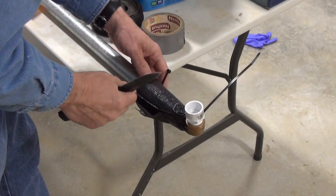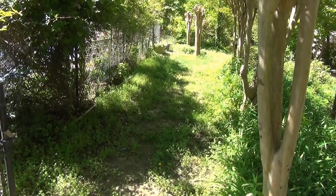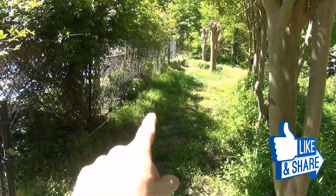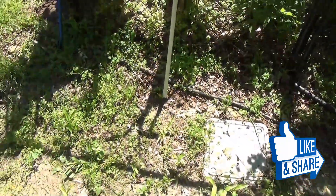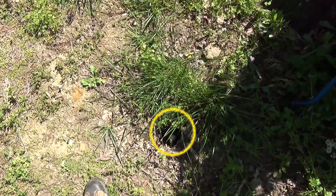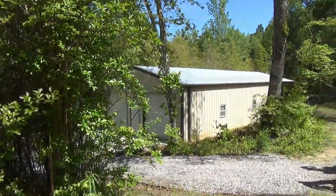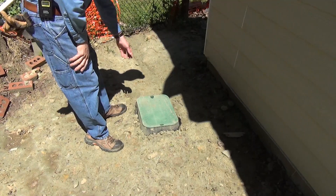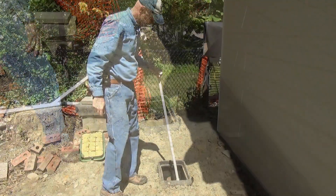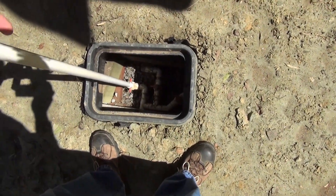As you may recall from when I was building my shop, the water line comes from behind the pool house and under the walkway, and comes along here. I have a tee off that pops up to the ground here that we're going to dig back down — that's basically serving as a marker. That's where I have to dig down to get to the pipe, which is about two feet deep. Then it goes on and meanders around to the shop. So the first thing to do is cut off the water from behind the pool house. I use my handy PVC valve tool to turn the valve. Now onto the installation.